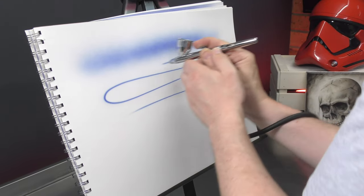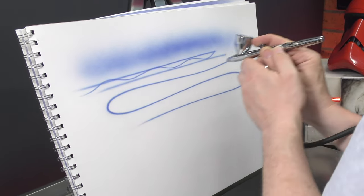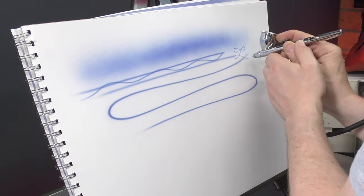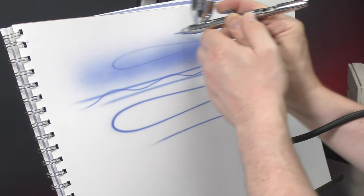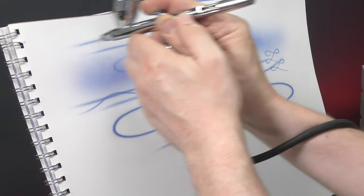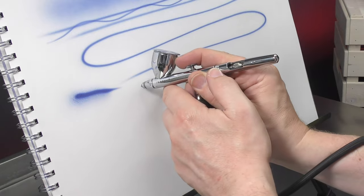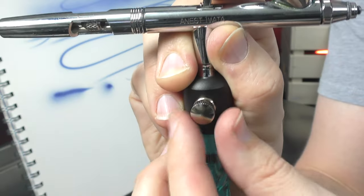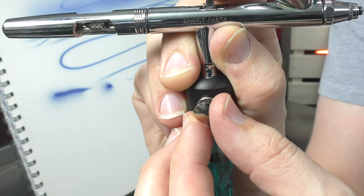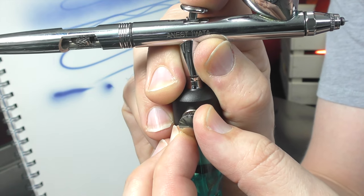This is working beautifully. I do like my paint quite a bit thinner — I find it just allows for nicer control. However, it does take longer to get the feel for it. You're more likely to spider out, go too heavy, because it is a lot thinner. The MAC valve is totally wound out, which means I'm getting the full PSI coming through at 30 PSI.